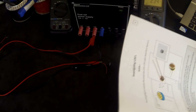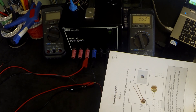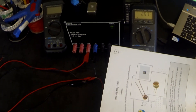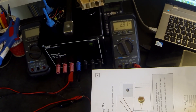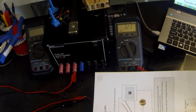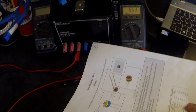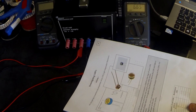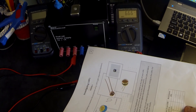I'm going to halve that distance to about 5 centimeters, and you can see that the resistance has increased to about 2.6 kilo ohms. I'm now going to drop it down to about 2 centimeters and the resistance has increased to about 2.9 kilo ohms. I'm going to drop it down a little bit more to one centimeter and it's at about 3.3 kilo ohms. And now I'm just going to rest the paper on the top — blocking out light from the side — it's sitting at about 6.6 kilo ohms.